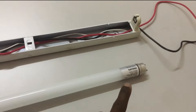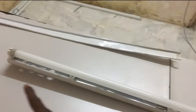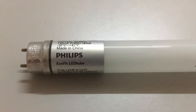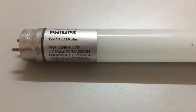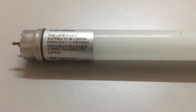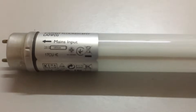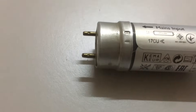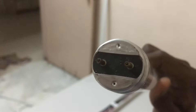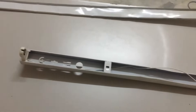This type of LED light will not work with that wiring configuration. Even if you try to put it inside the bulb holder, the light will not work. Let's look at the wiring specification for this LED tube light. The specification looks similar to the other LED light, but looking further, there is an important difference — the live and neutral incoming wires connect through two pins. When we look at the pins, they already have labels for live and neutral. This is why this wiring is not suitable for this type of LED tube.